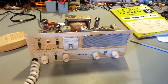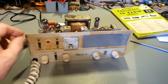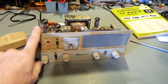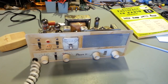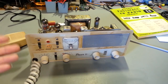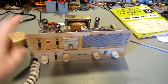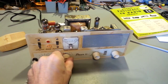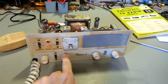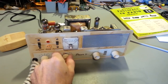So, yeah, like I say, that's actually exactly half of the transmit frequency. So it actually has a doubler circuit. Where, like in a lot of the more modern solid-state radios, they actually have a tripler circuit for signal synthesis. But like I say, what this allows you to do is only put transmit crystals in this, and then you have a tune control, okay? And that allows you to tune in then.